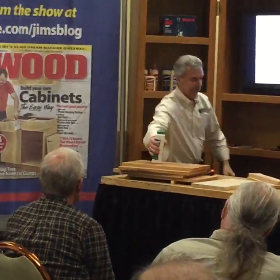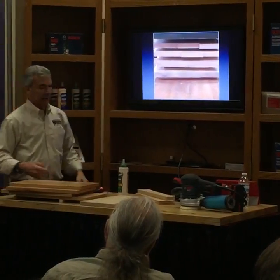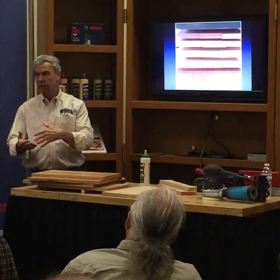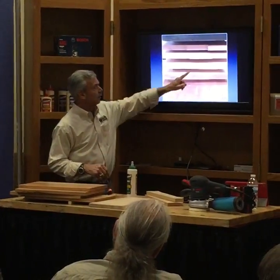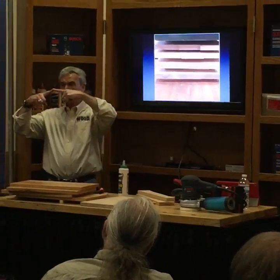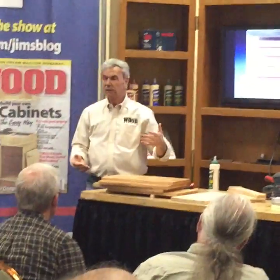Okay, last thing. No matter what I do with these, when I'm done with it, they go back in those stickers like we talked about beforehand. I put water on here, I wash that board, I put water on the surface, it's got to get out of there. Even if you glue it and scrape it, the glue, and don't hold me to this, goes maybe 1/8 of an inch into the pores on either side. You temporarily pucker that wood. There's enough moisture that gets in there. It's got to come out. And during the fall, it's going to take longer.